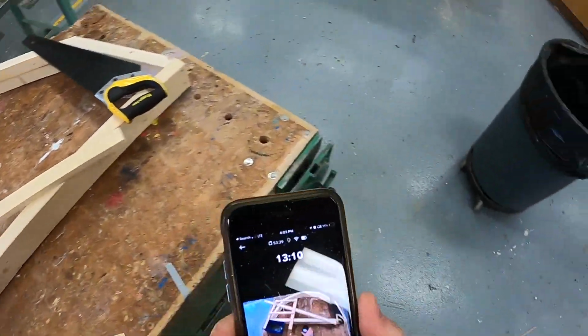On this one, the emergency stop might be pressed in. You pull that out, and the stop button might be twisted, so the power button no longer works. You can twist that, it'll pop out. Make sure the emergency stop is out. It's a pretty loud tool, so I'll stop talking, but I'm gonna sand down to that line. It should not take very long. While I'm sanding, I'm gonna be moving my project, because if I leave it in one spot, the friction is gonna get so much that it'll make scorch marks on the wood.